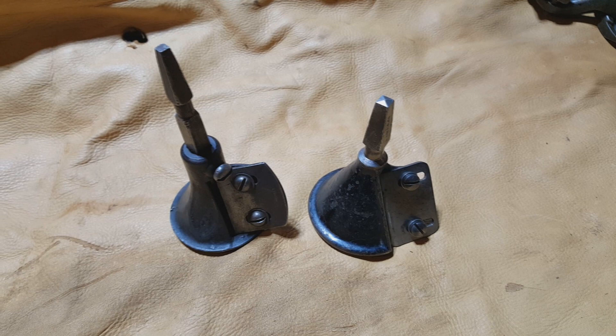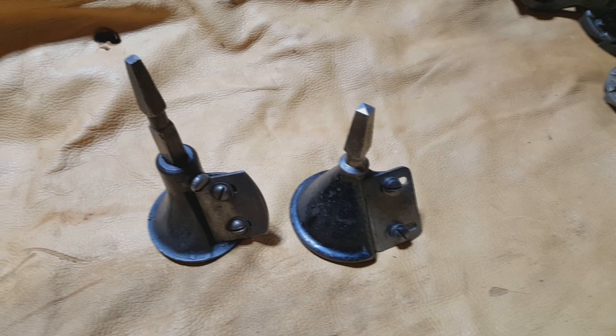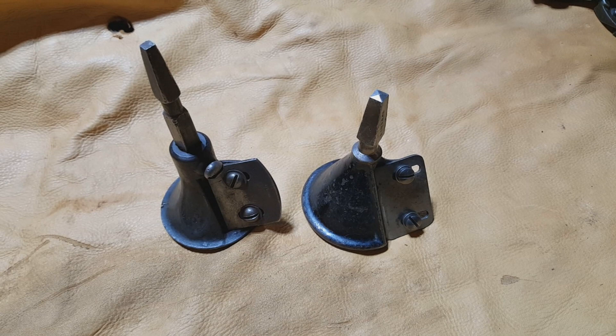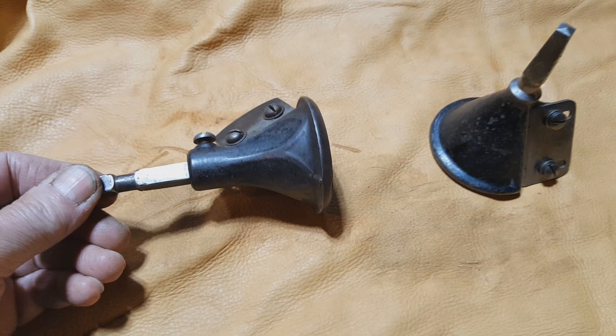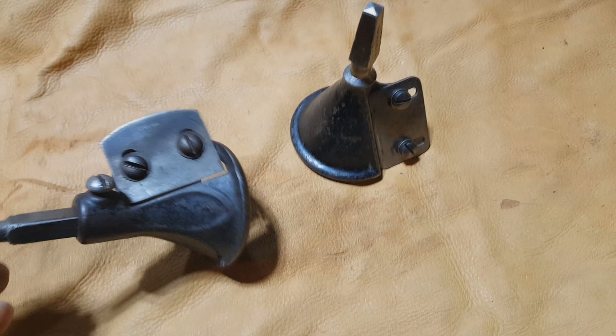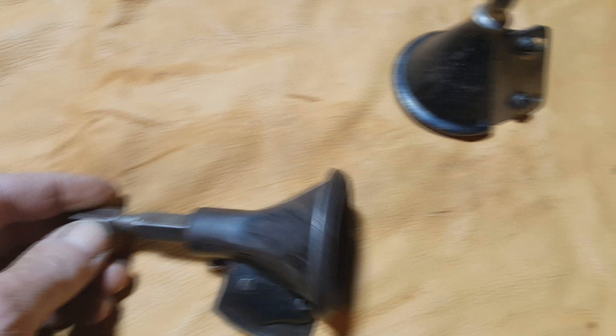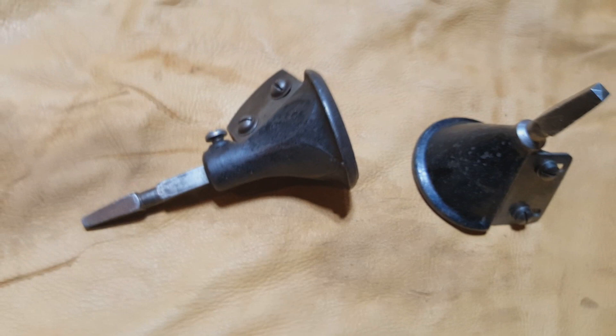First up are the spoke pointers. These are used to round down or taper the end of the stalk slightly, so it will fit into the hollow auger that you can actually cut the tenon with. You'd be surprised at how many people I've run into over the years that had a hollow auger and couldn't get the thing to work, because nobody bothered to tell them about the spoke pointer. One of the most common ones you'll find are the EC Stearns. You can tell that by the decorative casting on the bell. This one, unfortunately, has a cracked blade, which is why it's still here. These do have an adjustable tang that's ruled to be used as a depth stop. Edward C. Stearns was granted a patent on October 7, 1879 for the design of this tool.